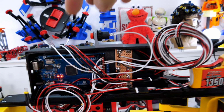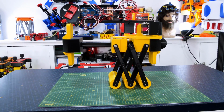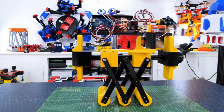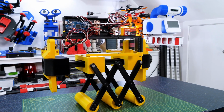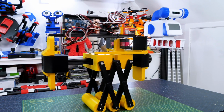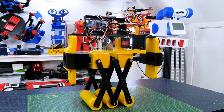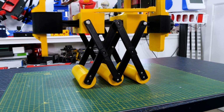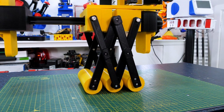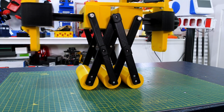I fitted an enable switch which starts all the timers, so now we can see with that ramp library running, driving the servos, we've got a lovely smooth motion. So you can see the whole thing expanding, contracting at one end, driving the spine down, expanding again, contracting again, and repeating it. But it's moving much smoother than it was. Each action out of the 3 actions here takes 1 second, so it's a 3-second cycle, interpolating with that library, with each being a 1-second move.